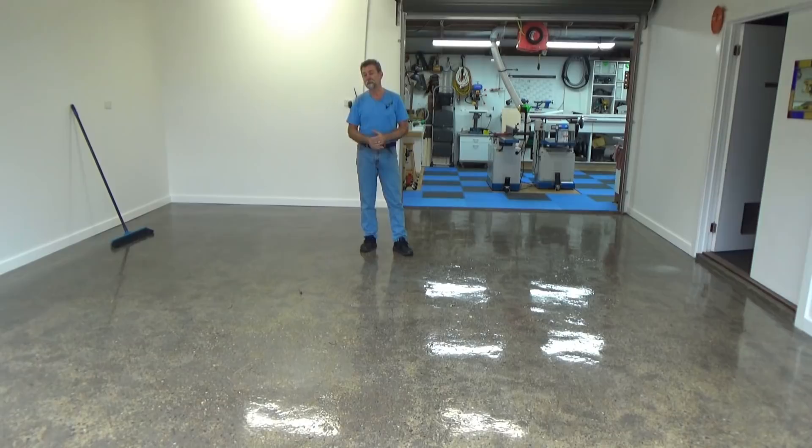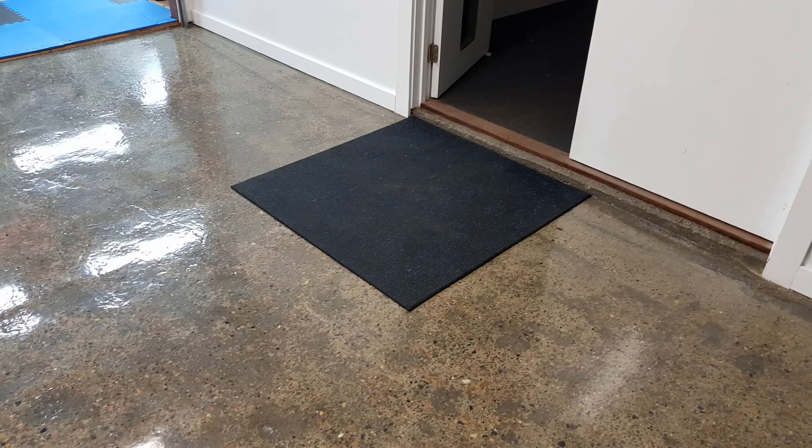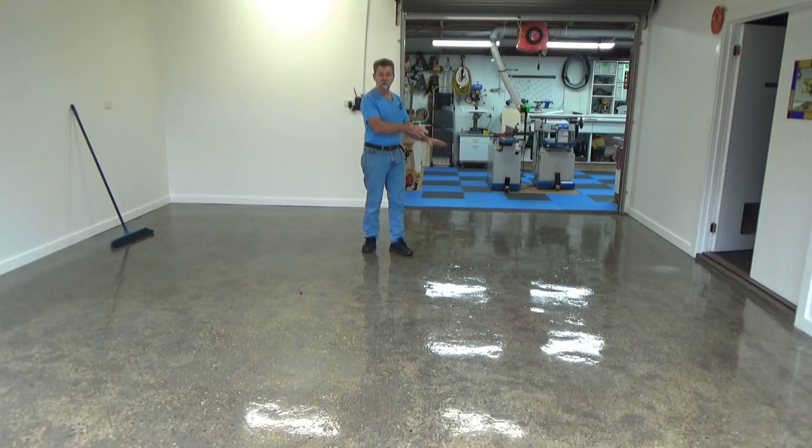I don't want to do any grinding with my bench grinder. The reason being, I don't think sparks are going to be very good landing on the epoxy finish. The epoxy is basically a paint — a very, very hard paint that sets harder than ordinary paint. The imperfections in the floor ended up being a bit of a headache. With those dips, I wanted to start filling them with the epoxy — bad move, don't try it. The epoxy will go cloudy; the thicker you make it, the cloudier it is. I've got a part over on the other side of the floor where the depression was very deep and the epoxy actually cracked in there. I have a large one-meter by one-meter recycled tire mat I'm going to put over that depression and no one will see it.